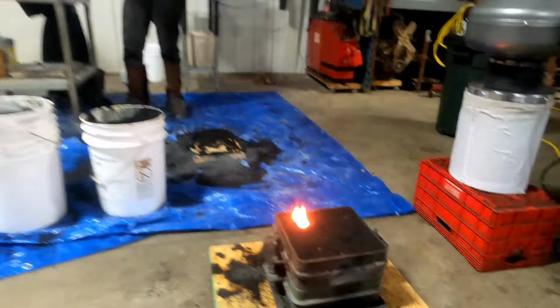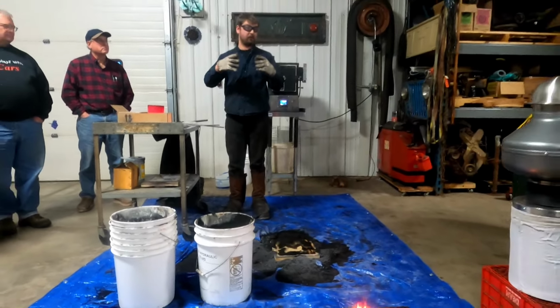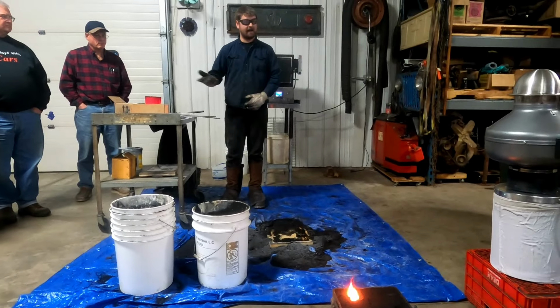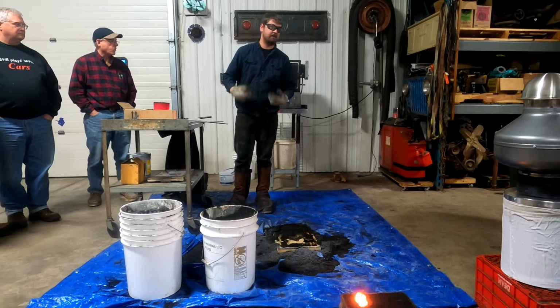So you don't want it to go into the crucible because you'll never get it out again. And the problem is then you can't test your crucible to see if it's still good. If your crucible has a crack, it won't ring. You go to melt, and then you open the furnace door and liquid comes out and hits your hands.